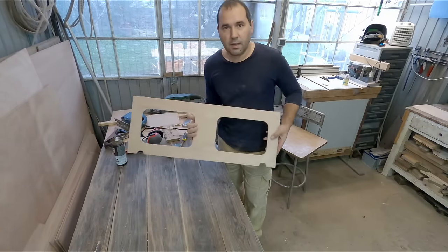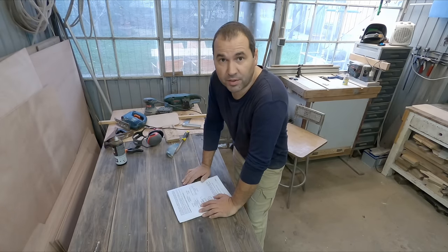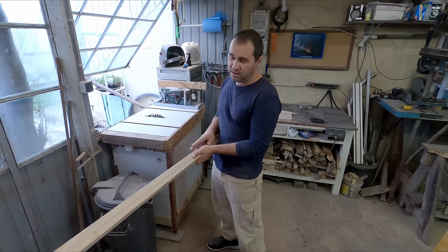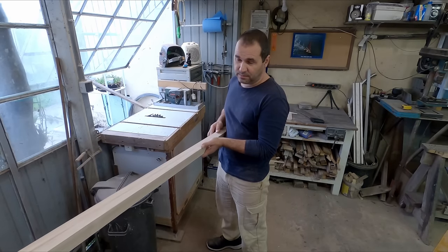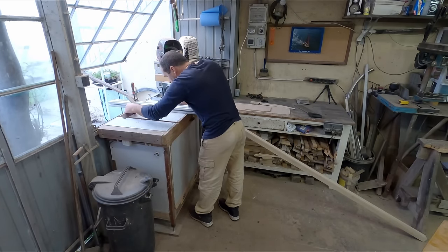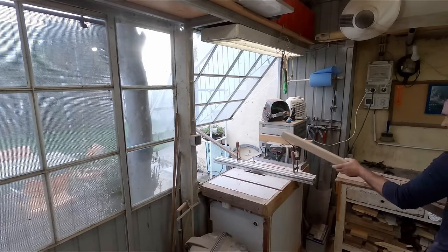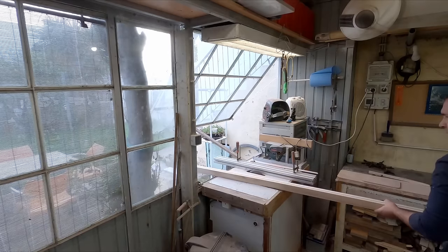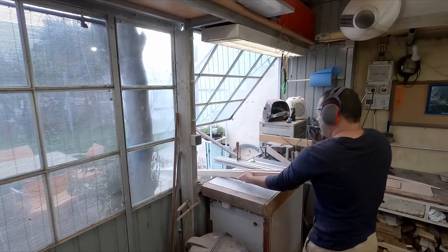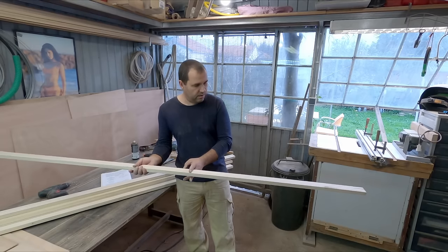That's the center case bulkhead done. Next I'm going to start some framing, but for that I need to rip some strips of polonia first. I need to use my table saw which unfortunately only has a depth of cut of about 30mm and this is 45, so I'm going to have to do one side and then the other. I hope I don't screw this up because this polonia isn't cheap. Now I have 45 by 20 and I will plane these shorter sections as I need them.